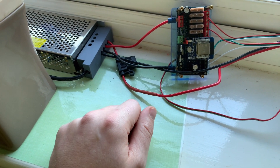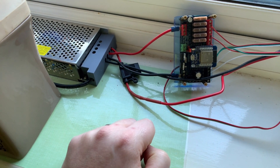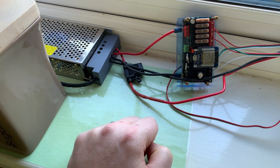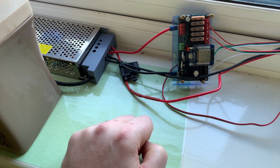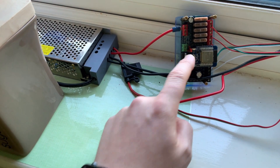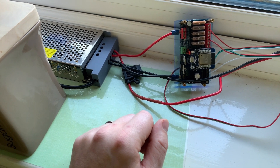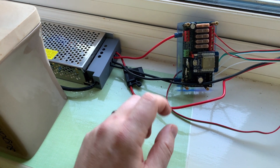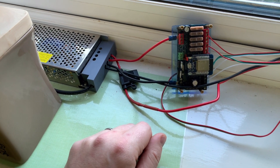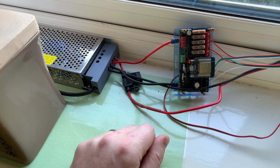The ESP32 is running WLED, version 13 — the latest one as of a few weeks ago — and it runs really, really well. It's able to run the 253 pixels of the tree and I think each of the windows has 106 in it, so it's doing those 450-odd LEDs absolutely fine.